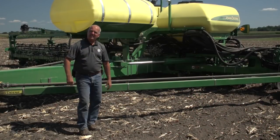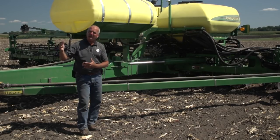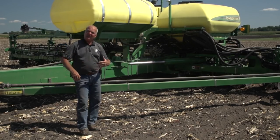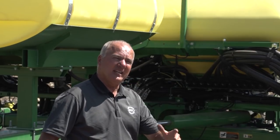So with the 360 700 gallon tank solution, we were able to put weight on the front and the rear of the axle of the tractor, and then bringing in the Gator system, where we spoon feed the right amount of weight as we go evenly across the field, hits quite a home run.